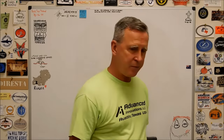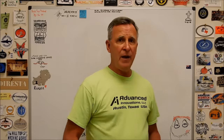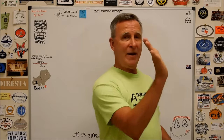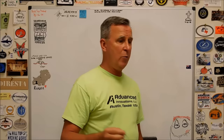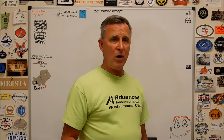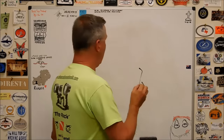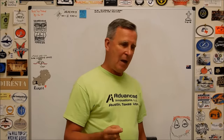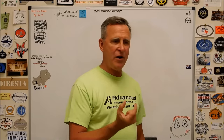I've actually seen guys drill holes where the drill actually blows out the side of the part, inside the chuck or inside the collet. And they pull it out and they go, hey, how come I can't see through the hole? Well, it's because it bent and came out the side. Drills are a lot more flexible than you think, and they will bend, they will flex, they will walk. So the most important part of drilling a deep hole is the beginning. You absolutely must pay attention to the very start of that hole.